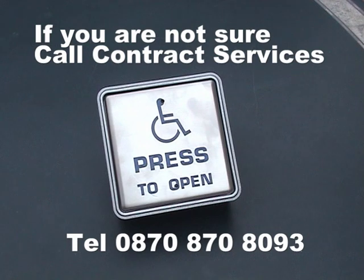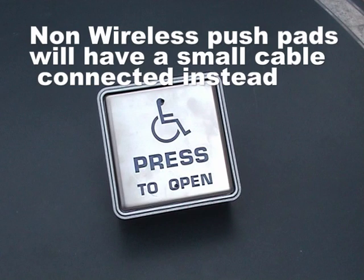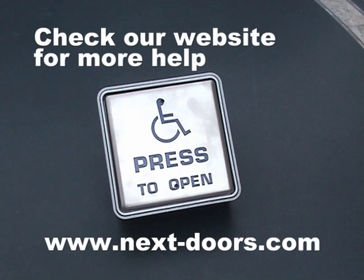I should also point out that not all push pads on the outside of buildings are wireless and require a battery change. The batteries, by the way, should last between two to three years. The timer on the little microprocessor circuit in the transmitter switches the thing off if it's not being used, so it does conserve battery quite well. Unfortunately at McDonald's restaurants you get large instances — particularly at some stores — where gatherings of kids or youths outside will continually keep thumping these things, and sometimes they do get kicked off the wall as well.